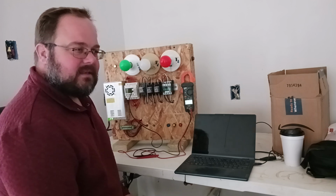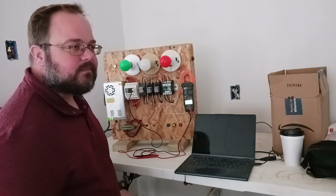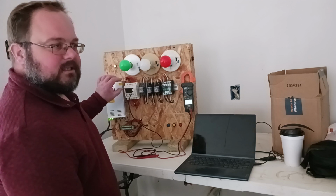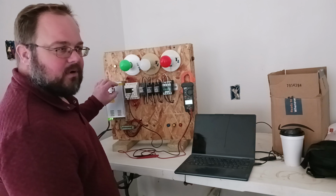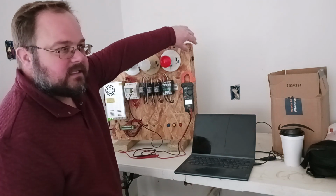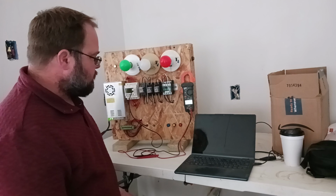So yes, there are ways, if you can't quite get into the PLC program, there are tricks to troubleshooting. It usually has to do with bypassing things, but let's just focus on knowing what's in the PLC and knowing there is a program that usually someone can get a hold of. And worst case scenario, they can print that program off for you, and you can see the contacts, and you can say, hey, this photo sensor is used as a counter, and I need to trip it 6 times to get my output. And then, we can troubleshoot from there. So that's pretty much what we're trying to learn.